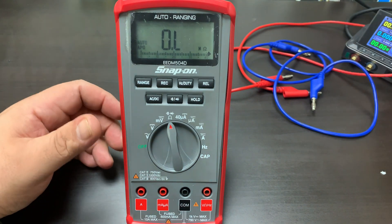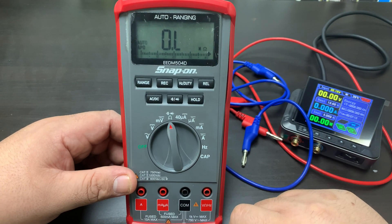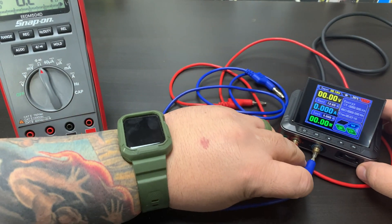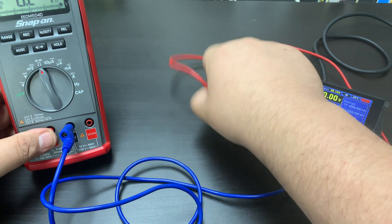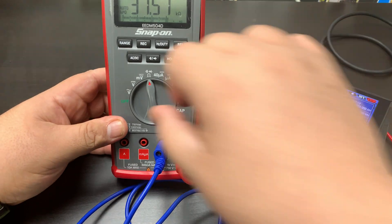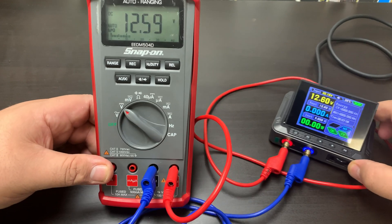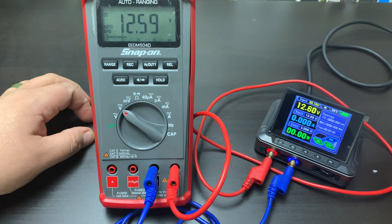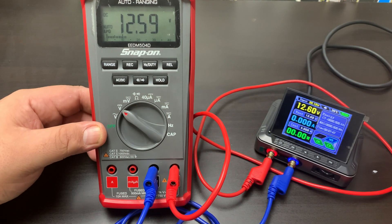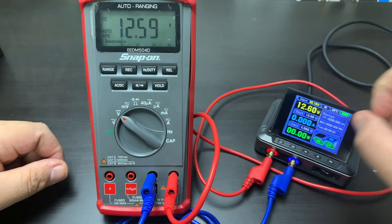The first thing I'm going to do is set up our power supply here and then set it to 12.6, and then see what we get on the actual meter. So we're going to be using ground as blue — it doesn't matter. That's why I like using different colors, because some people say it has to be black and red. We'll change that to volts DC. We'll hit run. So right now our power supply is at 12.6 and my meter is at 12.59. So the voltage measurement right there looks to be pretty accurate. There's actually no spec on the box for accuracy, but 12.6 output and 12.59 on the meter — that seems pretty legit.